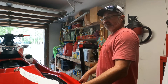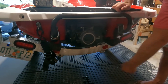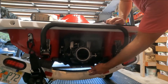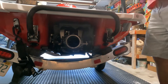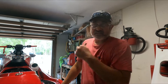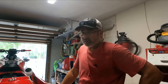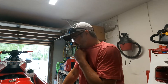The next mod is the Reva Yamaha Gen 2 ride plate. That was really easy — literally took 15 minutes. Remove the bolts, pop the old one off, put the new one on, use blue Loctite, reinsert, and done. Cost was $300. No top-end gain — it claimed one to two mph but I didn't see that — but I did see quicker plane out of the hole and less porpoising on top end. Worth it.